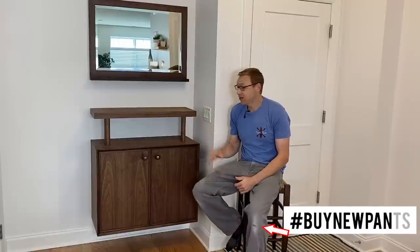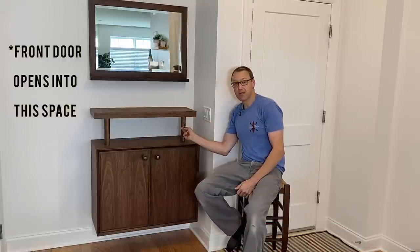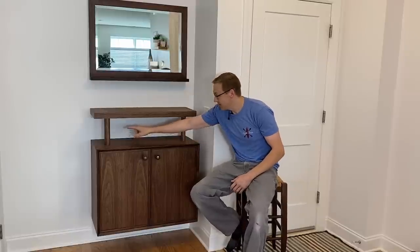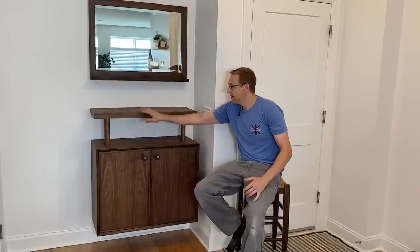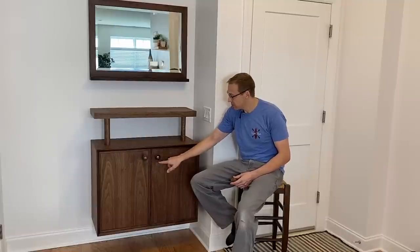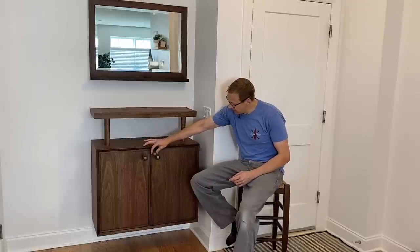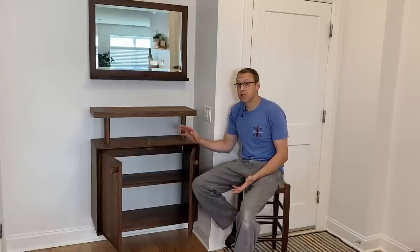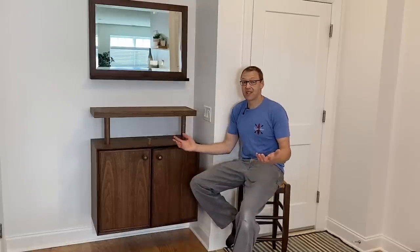All right, so there you have it. You'll notice that I have two posts up there now — the reason I didn't show you how I attach them is because they're not attached. I had a lot of air bubble problems with one of them, and every time I filled it and turned it down it kept getting smaller and smaller, so maybe you can see that this one is a much smaller diameter than that one — I need to redo it. Once I do that I'll attach these, probably screw from underneath. I also want to turn a couple of new knobs — these ones are just a little bit big, and one is a little greener than the other because the mix was off since I turned them at separate times. But all in all, I love the way it turned out and I'm excited to do a little more experimentation with the brass powder and epoxy to see if I can really dial this in and make these look even better. So until next time, thanks for watching.